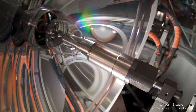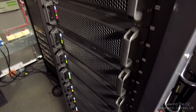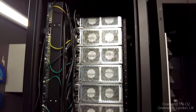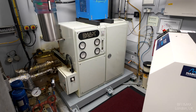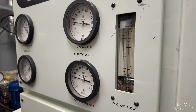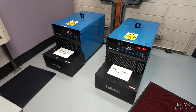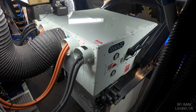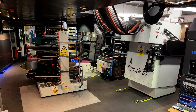So what if we replace the Xenon lamp with a custom-built laser light source? Modern laser light sources can be rack-mounted and located outside the projector. The light produced by the laser would travel to the projector via a fiber-optic link. This setup would eliminate the need for the bulky water cooling system — including the pumps, reservoir, plumbing and external chillers — as well as the massive current rectifiers. In fact, the entire upper lamp housing could be removed altogether, freeing up valuable space and simplifying the projector's design.